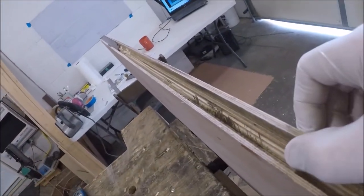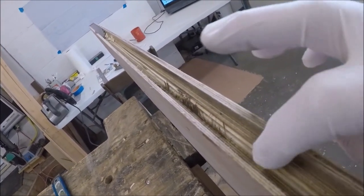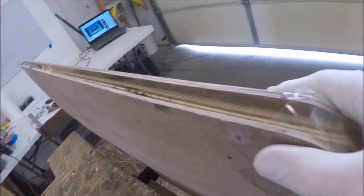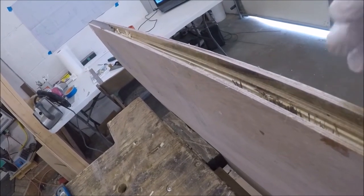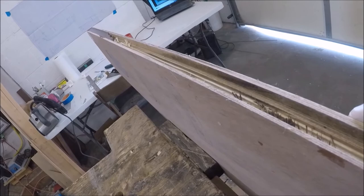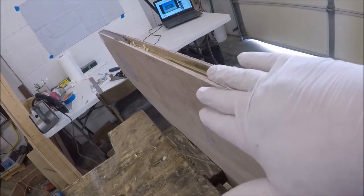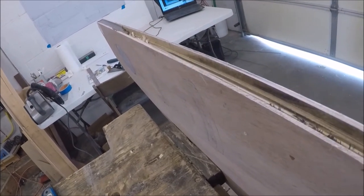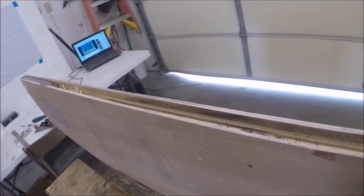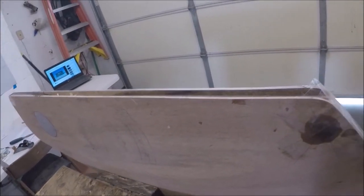But I wanted to go ahead and fill this void as well while keeping the epoxy in my hole. So what I did is I set up my table saw a little bit from this edge and a little bit from this edge, and ripped it down half to three quarters of an inch. I've taped off the ends and I'm filling that up with epoxy mixed with a little bit of adhesive filler. This is the leading edge, and when I round these over with the big roundover bit later, that'll leave this hardened epoxy surface — so if you hit a rock or a barnacle or go up on the beach, you're contacting the epoxy first, not grinding away the wood.